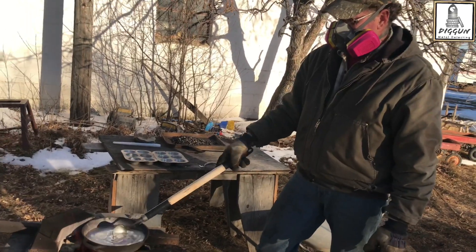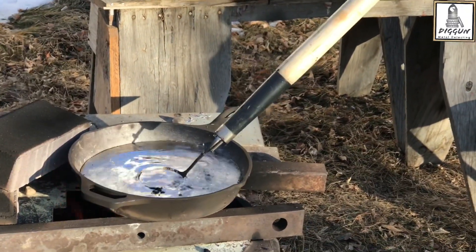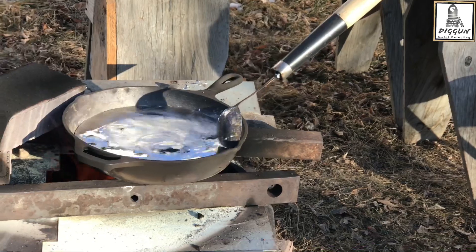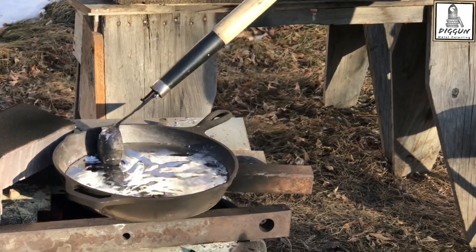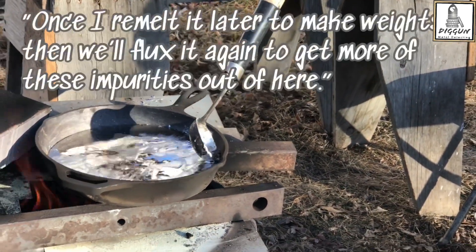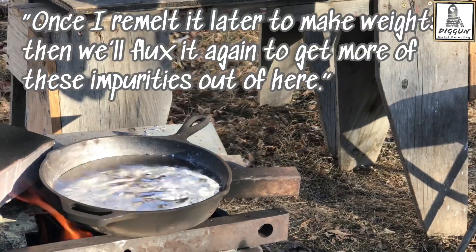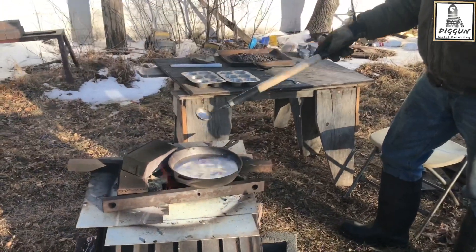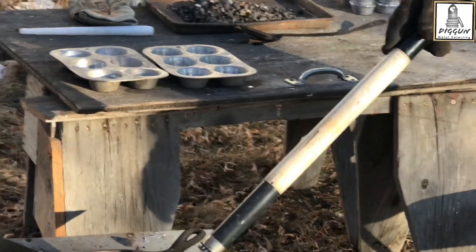So now I've got this old ladle that I put on a handle. For safety, because you don't want to get close to the sludge — it's about 650 degrees. I'm letting this warm up a little bit. So did you skim off all the crap, or is there still a little crap up top? There's still more here. Did you say you were going to do the wax fluxing again, or was that just a one shot? Not now. This is just a rough process. Once I remelt it later to make weights, we'll flux it again and try to get more of these impurities out. Now I'm just going to pour into these cupcake molds, which worked pretty good. I'm assuming I can never use those cupcake molds again to make cupcakes, right? Well, only for guests who don't really care for it.